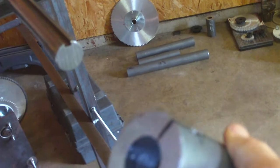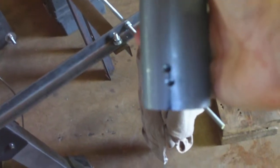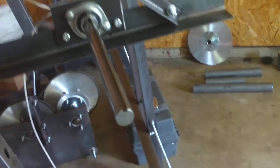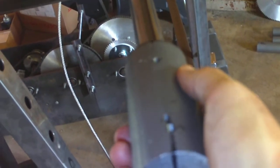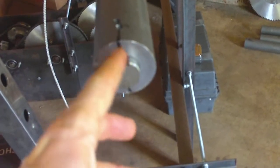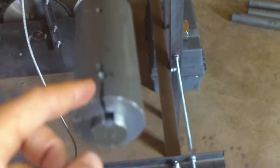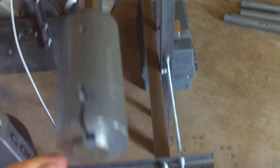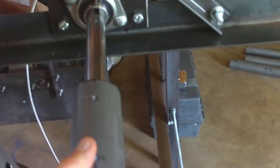So I had to spend some time honing it out a little bit, going old school since I don't have a lathe or CNC machine — just a round file on the stone. I got it done. I also had to drill and tap some holes for a set screw to go into the shaft. The plan is that this fits over the top of it, lines up with the keyway, and the set screw goes in here and another one there, meeting the keyway.